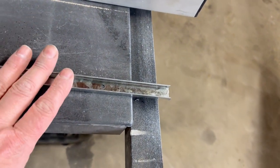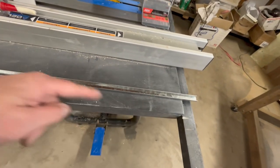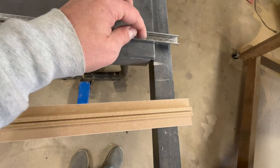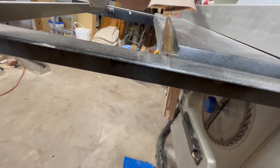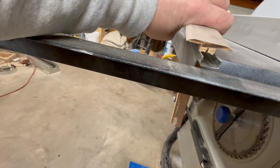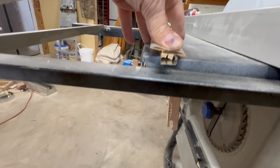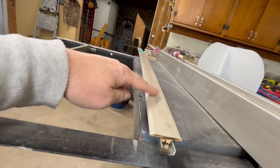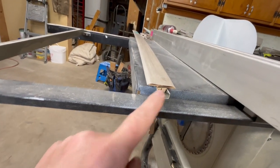I forgot to show you how to put it together — I'm not a professional but I've done a few of these transition strips over the years, so this is the easiest way I found. Once you get your strip fastened down in place, make sure it's straight — try not to get it wavy or bent. This groove is what's going to go inside. Get the one end in and started, push it down tight as much as you can, then work your way down the strip. Usually I use a rubber mallet and just keep tapping lightly and the whole thing will pop down.